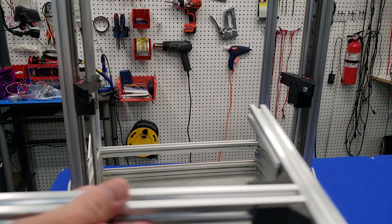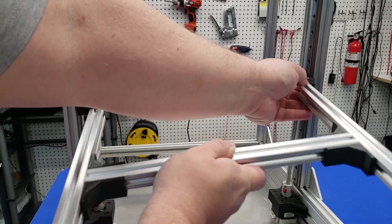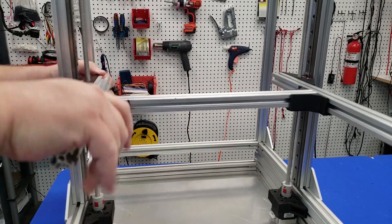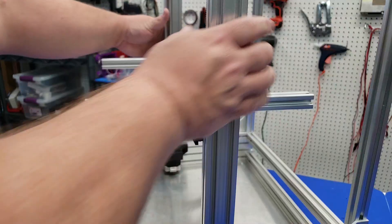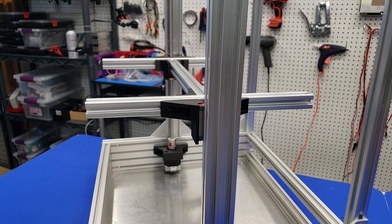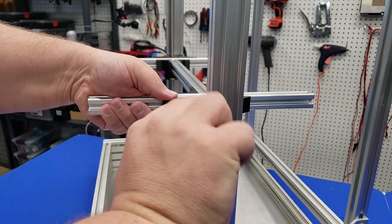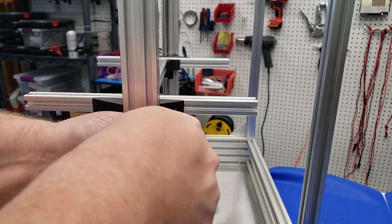You need to be patient putting this part in — it takes a little wiggling and fiddling. There's very little tolerance. Make sure the crossbar is completely against the two rails as you're putting it in. You'll have to wiggle it in, and it may even seem like it's fitting extra tight or squeak as you're inserting it. Once you get it all the way in and centered, tighten up the side nuts. If you turn the lead screws, everything should move up and down just fine. Just don't force it — wiggle it into place.